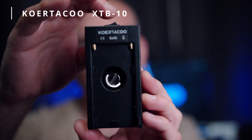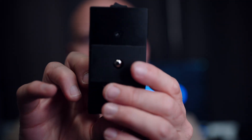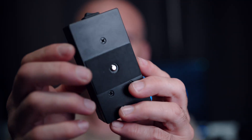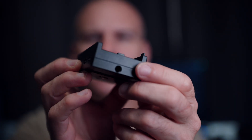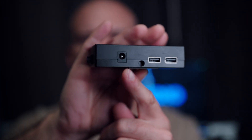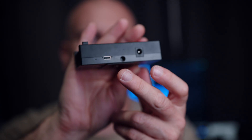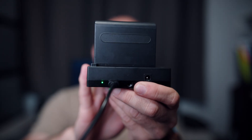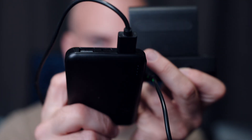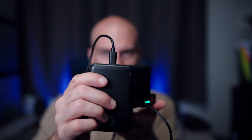Here's an NPF battery plate I've owned for quite some time. It has a definitive on/off switch and multiple mounting points, though only one mounting point on the back — meaning if the screw comes loose, it will wiggle around and not stay secure, which really drove me nuts. On one side we have an 18-watt and a 10-watt USB, plus a 12-volt output for a camera monitor. On the other side there's 8 volts out and a USB Type-C for charging batteries. Note: the Type-C does not work for power delivery on this unit — use USB Type-A to charge the battery bank instead.